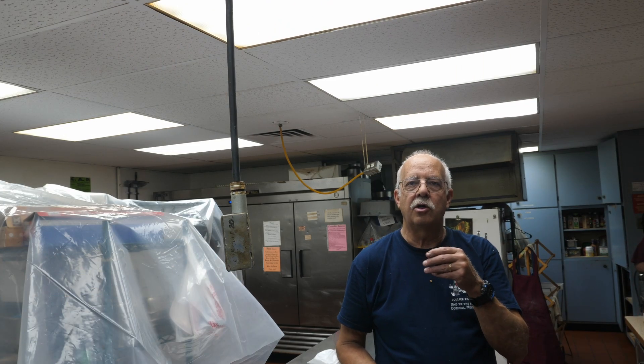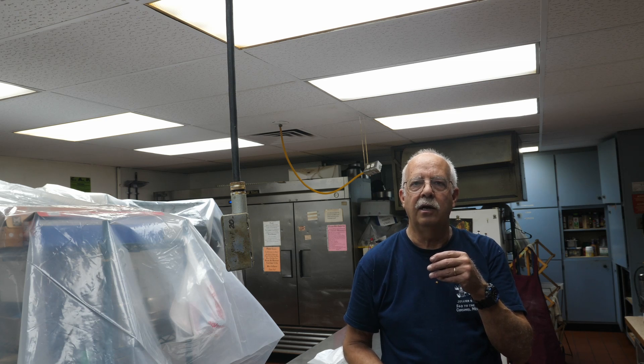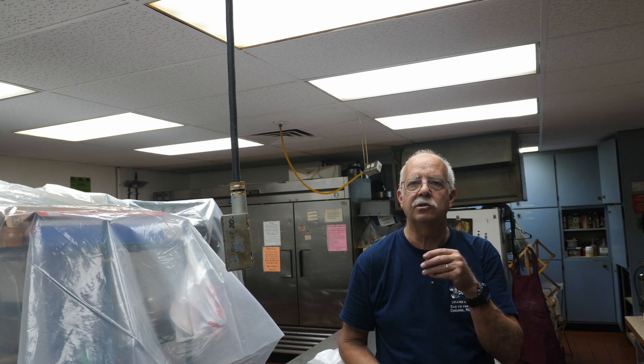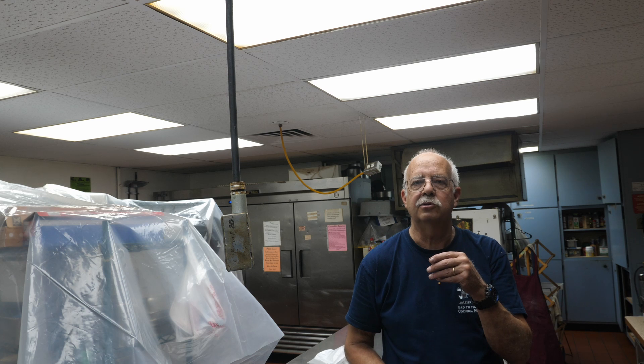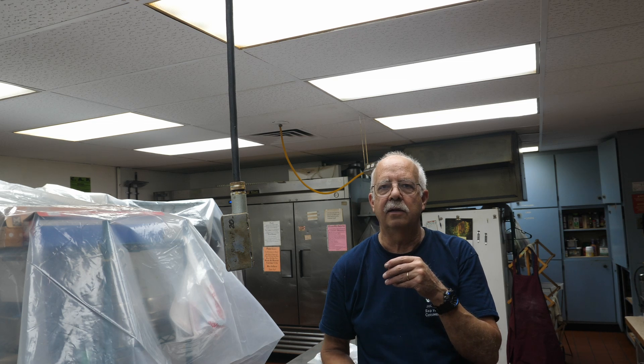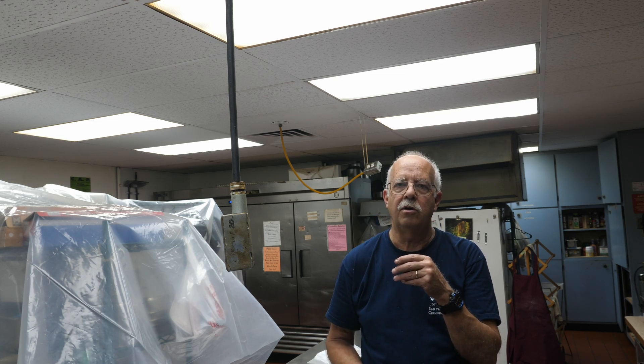Our project's done and as you can see it's a whole lot brighter and whiter in here. These LED lamps pull 23 watts where a conventional fluorescent tube will draw either 32 or 40 watts, so it's basically using roughly half the power. That'll definitely save on the electric bill, and the lifespan of these is quite a bit more than fluorescents. I'll put a link in the description for where to get these lamps on Amazon. There are nine lights in here and it took me about two hours — not bad, and that included getting things cleaned up.